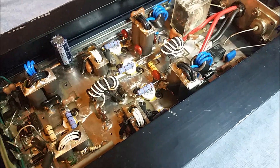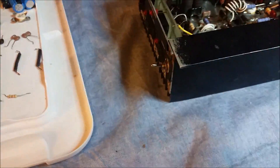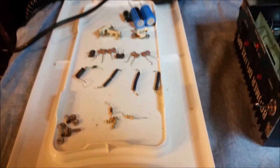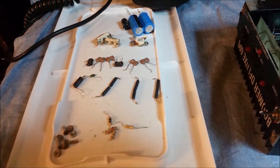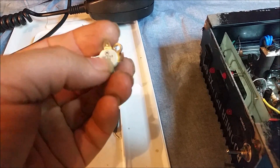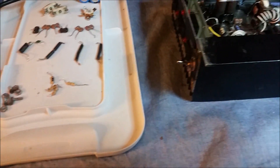We're going to test this thing out on my normal AM radios first, then hook her up on the 148 and let you see her working on sideband. Basically, here's what we took out of it — here's your old transistor. It was blown. Luckily I had a brand new one from RF Parts, which is the last one I have. I think I've got two or three more of these amps in repair — I hope none of them have blown pills or I'll be ordering more.